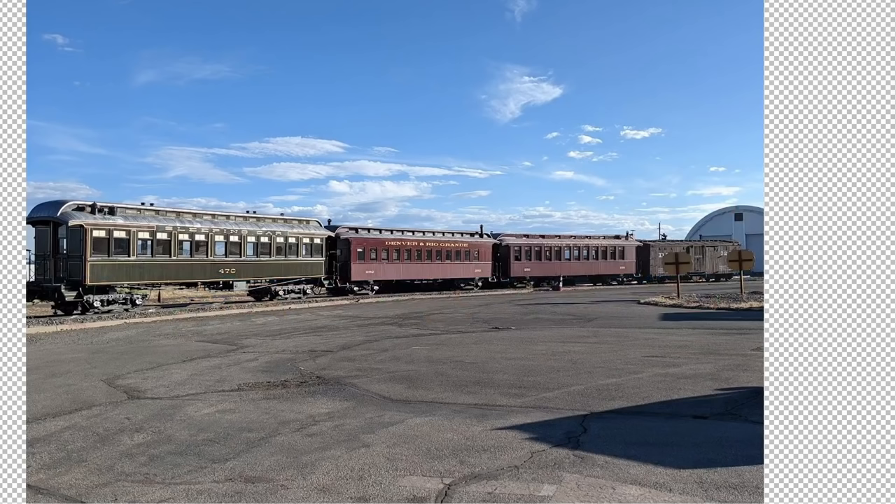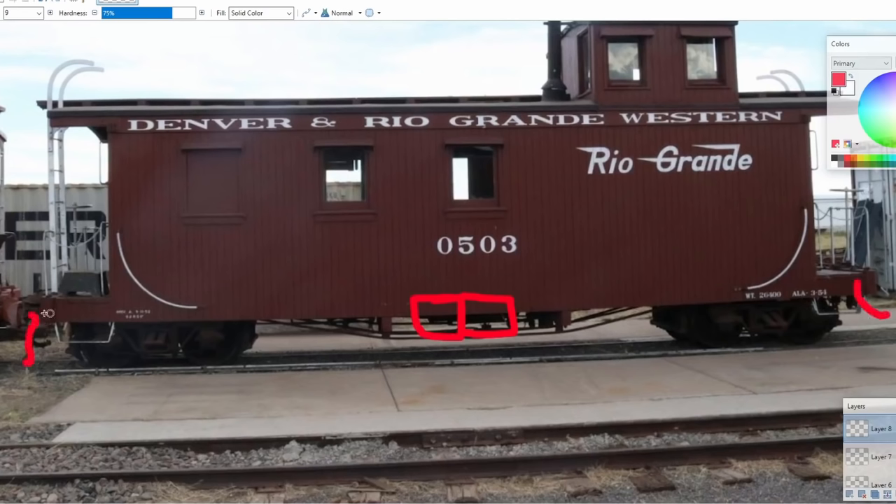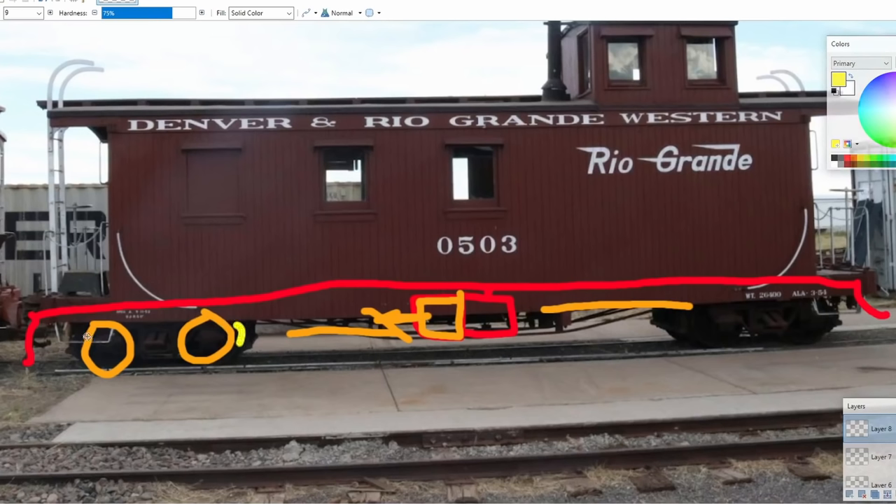What's level five? Level five is understanding how the rigging actually applies the brake sets to the equipment. Typically on a piece of railroad equipment, we have the reservoir tied into the brake cylinder, with hoses on either side and a brake pipe running all the way through the car. The cylinder can press outwards through a series of levers that send force to the trucks. On the trucks you have wheel sets, and typically you'll have brakes on either the inside or outside of the wheel sets.